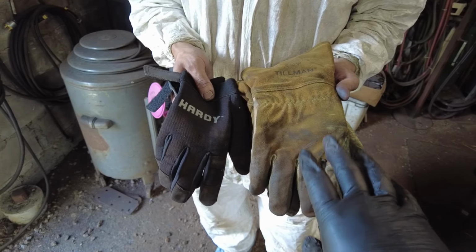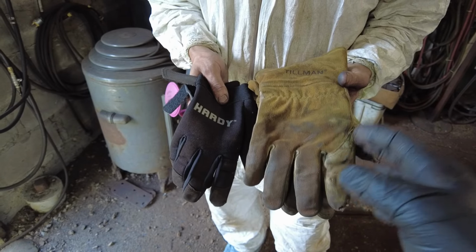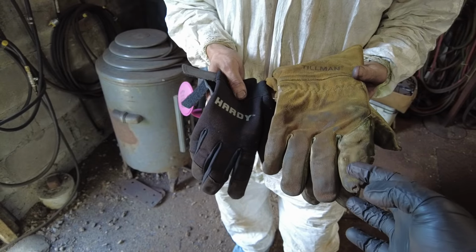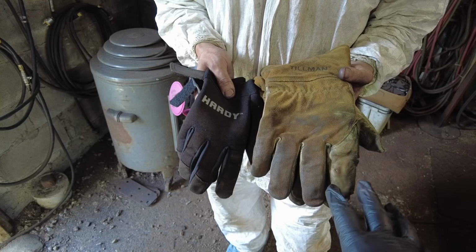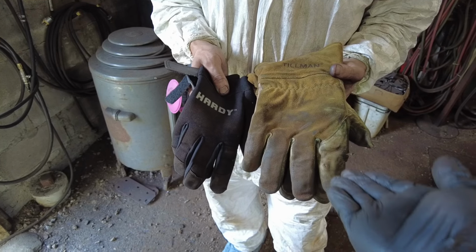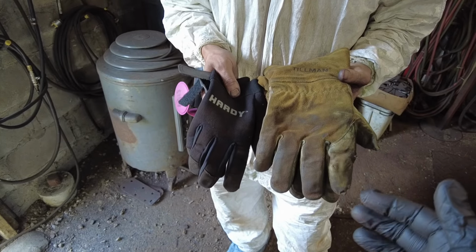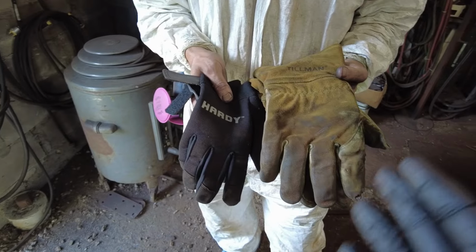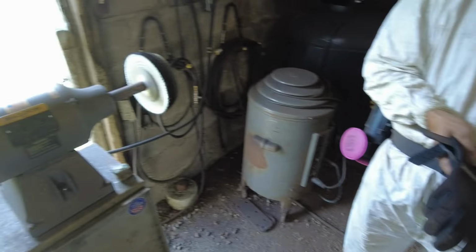This will get hot. Even wearing gloves on a long polishing session, to get the buff in there, you will get uncomfortably hot polishing and buffing the copper because you're holding it against this wheel that's creating a ton of friction. And I've gotten the copper so hot that it literally fries water. So water will boil off on the surface just by buffing.